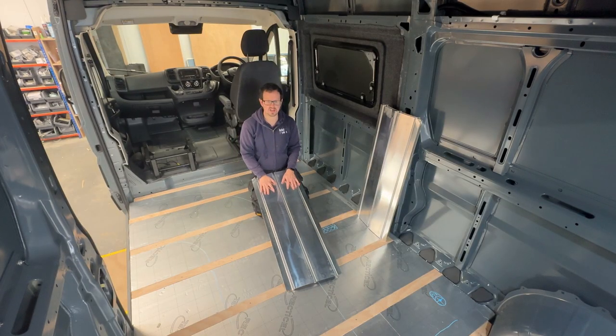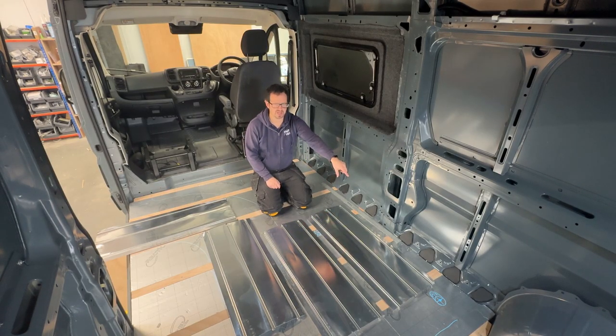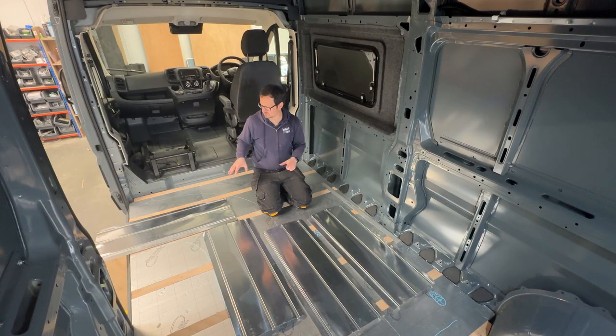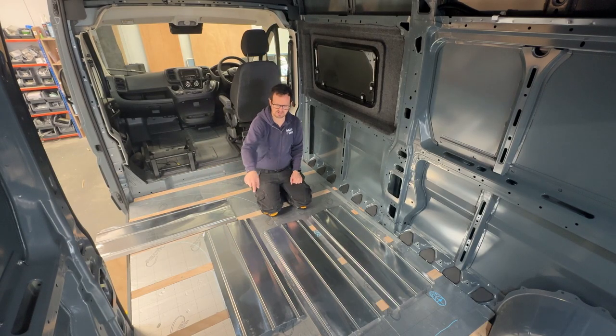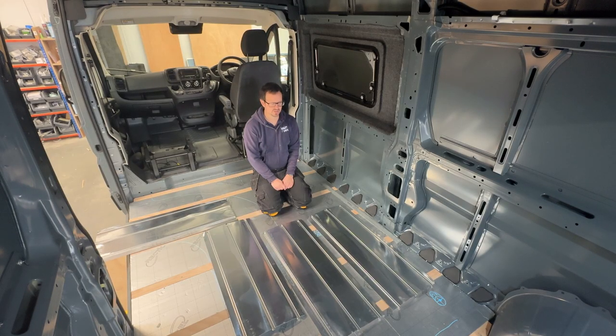These are the aluminium plates that you get with the kit. We just need to work out exactly where we're going to put the pipes and the plates in order to get heat distribution throughout the floor. These are 150-millimetre centres and our pipes are going to be running up and down inside these channels. One thing to bear in mind when you're planning this is that the pipes do need to start and finish in the same place. From the calculations I've done it looks like we're going to finish over here, so I need to put one return going back around all of the pipes and then back up this way. As long as it's starting and finishing in the same place, that's the main thing. So the next step is to start marking it up on the floor and then we can start cutting.